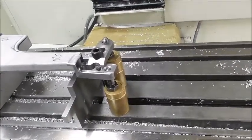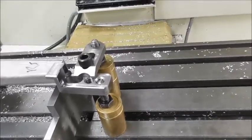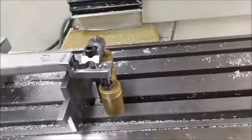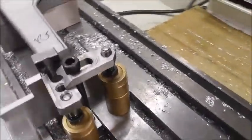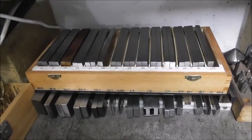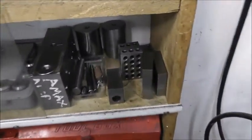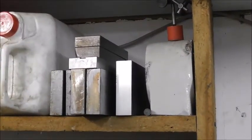You don't need to be constrained by the T-slots. If there's no T-slot underneath where you want a clamp to be, you can shift over to where there is a T-slot and clamp down on your clamp. In this situation there's no T-slot in the ideal place, so you can stagger the positioning using a second clamp. Obviously parallels are really important — adjustable parallels, fixed parallels, one-two-three blocks, and that type of thing are all useful. Sometimes you need big parallels as well.